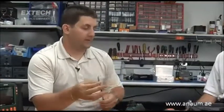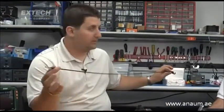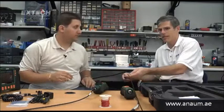Regarding the cameras in different kits: we have an extensive offering going from a 4mm camera all the way up to a 25mm camera. The 4mm camera is very thin in diameter, comes in a flexible shaft only, and is offered in one meter. The resolution on this camera is 320x240 pixels. All the other cameras — from 5.5mm up to 25mm — have a resolution of 640x480 pixels. The 4mm is always bought as a separate accessory and is available in one-meter length only.